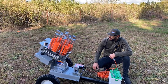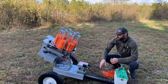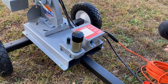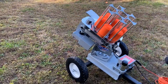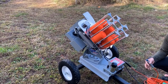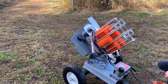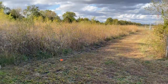You'll notice this time when I fired the trap, it started to move. When these switches are in the up position, the electric timer inside the control box takes over. Every time you fire the machine, it will reposition itself — anywhere from a half to six seconds later, it will time out. This makes it less predictable and also saves your battery life and protects the motors. You don't have to wait for the machine to stop; you can fire it as soon as it recycles, which is about 1.4 seconds every time.